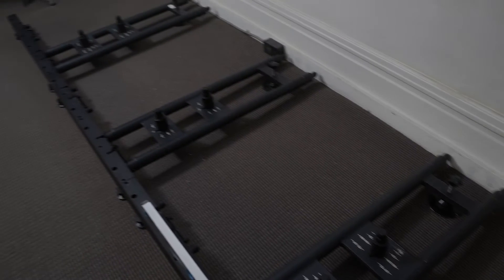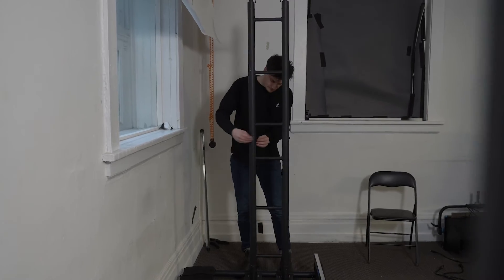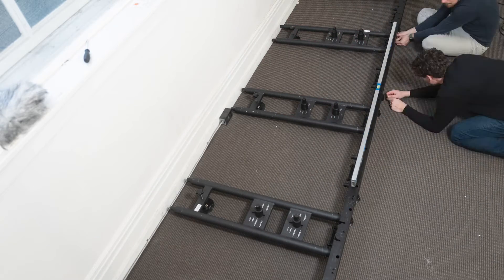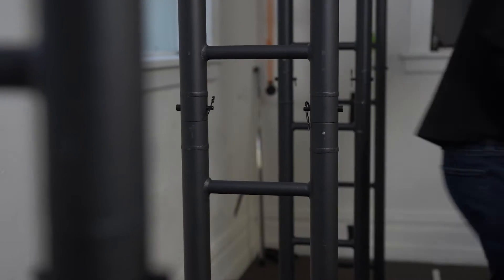Every LED wall is going to come with some sort of support system, and for the majority it's likely going to be a ground support system. If you have anything less than 16 feet, ground support is the way to go; anything above that requires ceiling support and rigging points in your building. For ground support, you have these base bars that act as little L-shapes. Almost every LED manufacturer includes some sort of self-leveling system — usually two legs in the front and perpendicular leveling support in the back. You need to level everything on the x-axis and y-axis, because if the LED wall isn't on a straight structure, going upward the LEDs will crash into each other and cause damage.